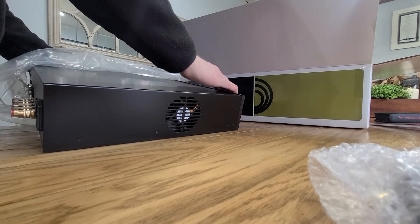This is the Dayton Audio APA 1200 DSP. This is a two-channel amplifier that can power either your main speakers all the way down to a two-ohm load, or it can be bridged and power one single subwoofer — up to 1150 watts. A really neat thing happens when we put this in bridge mode: we can auto DSP the subwoofer to make it sound the best that it can inside the room.